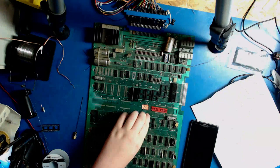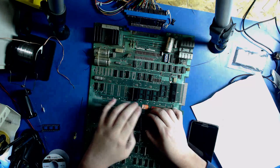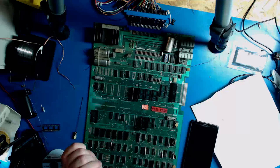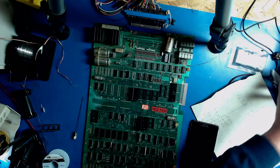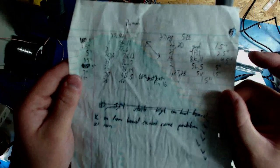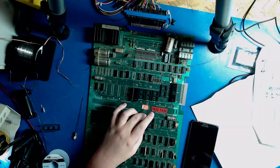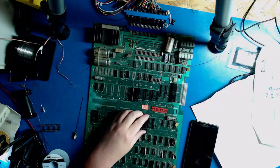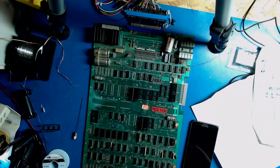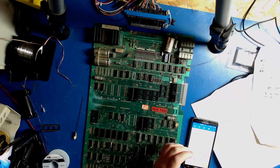The way I do it is I take a 24-pin socket and I pull all the pins out. I actually remove the pins in the socket that correspond to each one of these positions, and then I take a 28-pin socket and do all the soldering to that, so it sits more flush in the whole thing. I found this works better, because if you just use one socket, when you ship it, it moves around more, and then it doesn't work when it gets to whoever you're sending it to.